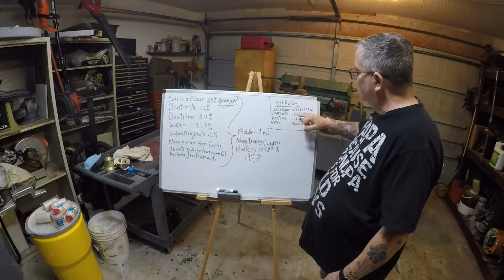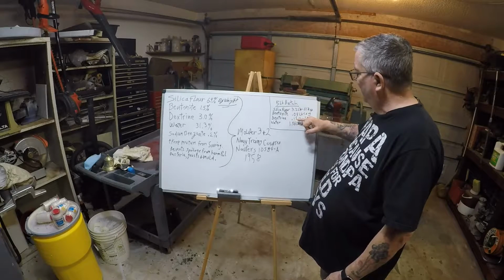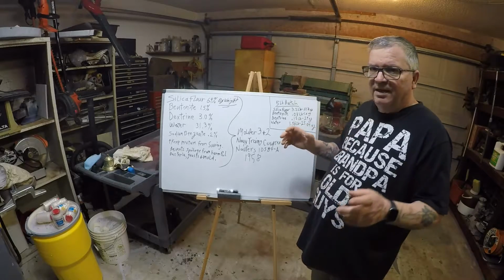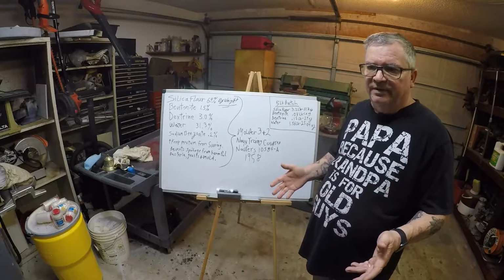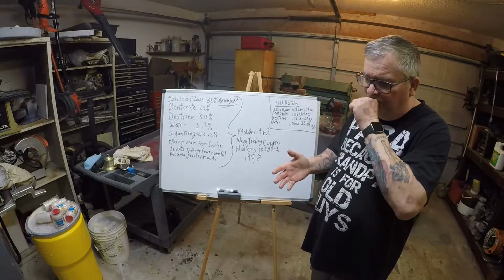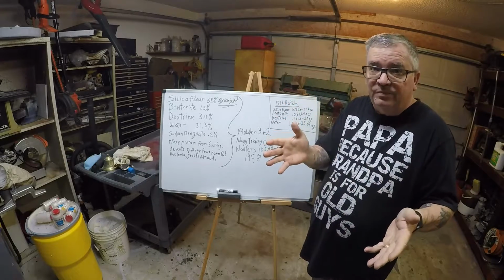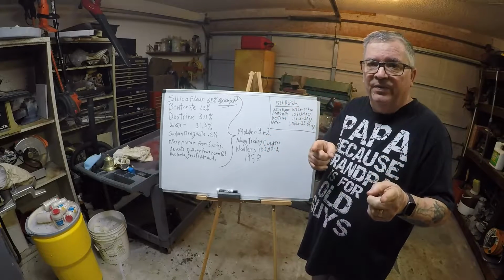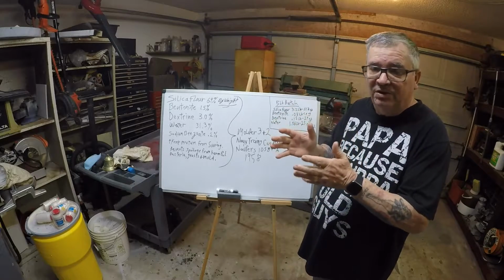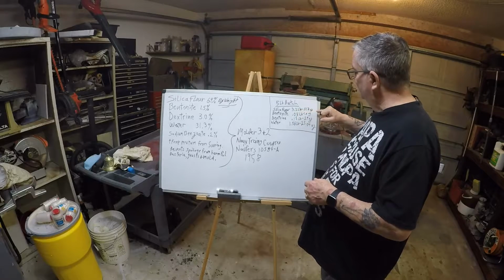Bentonite is 0.08 pounds. Dextrin will be 0.15 pounds, and water is 1.56 pounds. Now I don't have the kind of scales that'll give me pounds in decimals. So because I do have a scale that'll weigh in ounces, I broke that down into its equivalent in ounces.